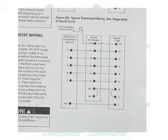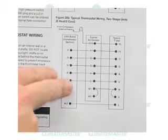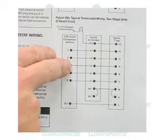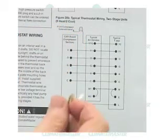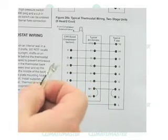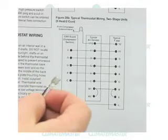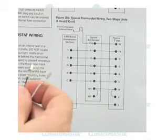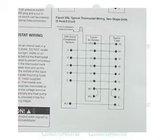So when you look at the total number of wires that you're going to need, look at what's even in the diagram here. You're going to need 1, 2, 3, 4, 5, 6, 7, 8, 9 with the FP2 sensor. So you're looking at pulling probably a 10 conductor, because that's what you're going to get out in the field, in order to run from the air handler to the split unit.